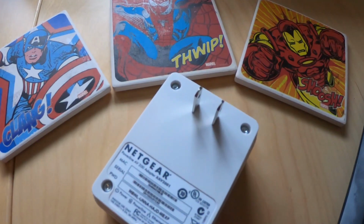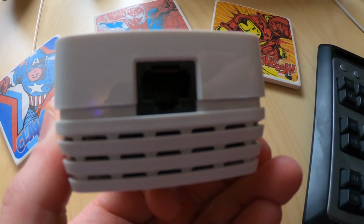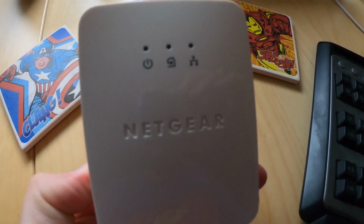And if you're struggling with locating, because let's be honest, as you buy a new home or go and get a new place, you're not necessarily going to be able to plan everything out. One of the tips or tricks that I have been using for a long time is Ethernet over power devices, and this allows me to locate my hubs really anywhere without having to run Ethernet cabling, and I can use a little unmanaged switch to attach to all of them. This makes it easy to locate them wherever I want in my new home.